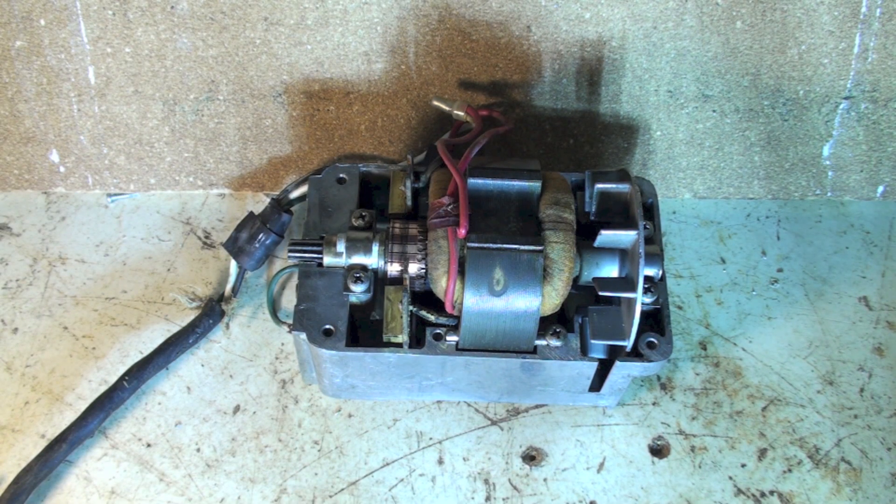This one's about the brush motor. There are still plenty of them out there — these were actually some of the original motors used. They're still found in drill motors and things like that. They have some advantages: one is they'll run on AC or DC, and two, they have very high starting torque — when you turn them on they really take off from zero RPM with maximum torque. They're not the most efficient motor, but operation is actually pretty simple.